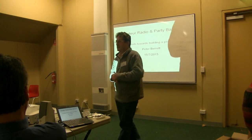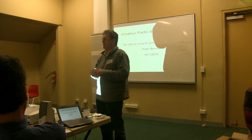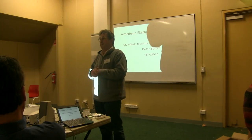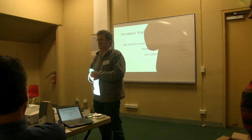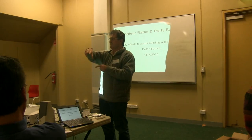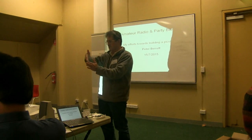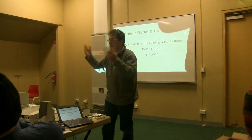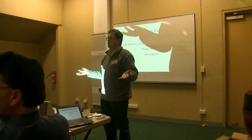You might have heard in our net the other night that I spoke about rejuvenating tired SLA batteries. Anyone hear that? Okay. Since then it's moved on a little bit, and I got this idea off a YouTube video that someone posted about rejuvenating tired SLA batteries. You cut the top plate off the top of the battery, and to do that you run a razor blade between the side panel around the edge, put a screwdriver on it, flip it off, and you'll see some rubber caps. Take them off, it's just like any other lead acid battery.